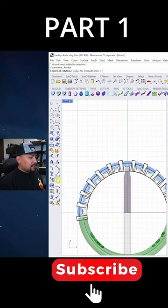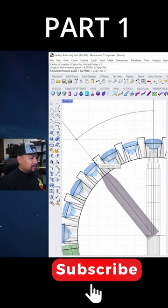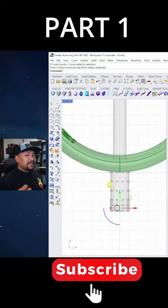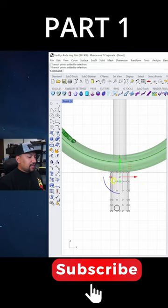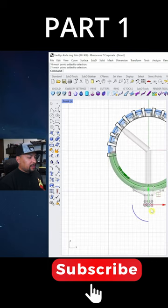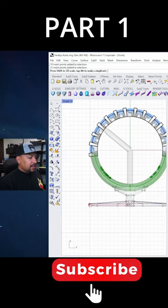Now this area, I'm just gonna rotate it to the best position so when it prints, it's solid and it doesn't move. To increase the success of your printing, what I usually do is I select this point and I make them wider. So here's where I build the base that is gonna be on the plate on the resin printer. And usually what I do is just make it as wide as the ring can hold.